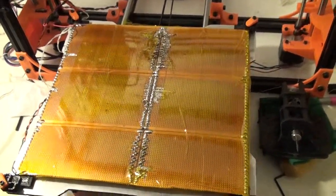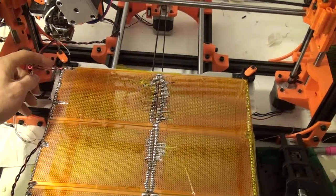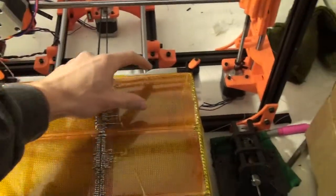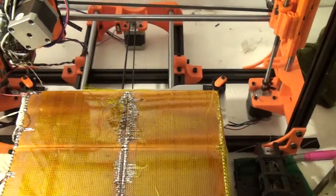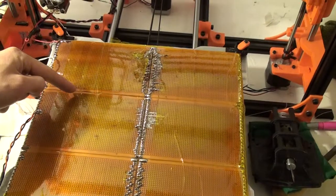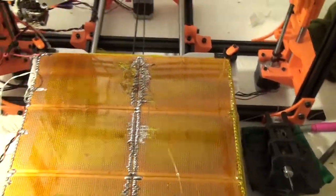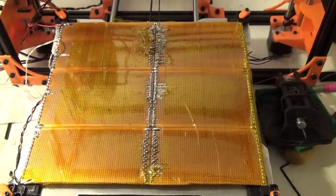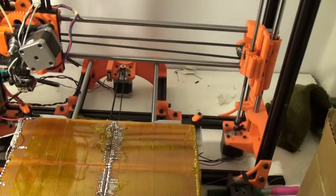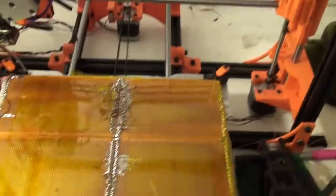That has occurred in this strip. There's one long trace that starts here and ends here, and it is in this chunk, particularly in this area, where I've had the most failures. That might actually be because of the position of this joint — this distance is shorter than this distance. So if you think about the way this thing is bending from the side, it's probably got a larger kink here. This board might be flexing more than the others and that's why it's occurring there. Or it might just be chance.